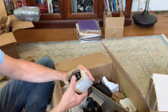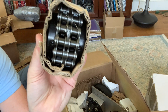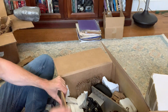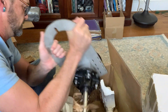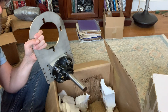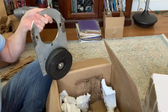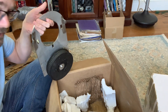Oh, that's the main coupler. This is what's going to actually do the grabbing — it's going to connect the shaft from this reduction gear to the shaft in the boat. This is the muscle of that connection. I love how heavy this is — it gives me confidence. So our motor is going to mount right here, shaft pointing out through here. We're going to mount a gear onto that, which is then going to have this belt going around, giving us our two-to-one reduction.